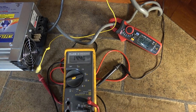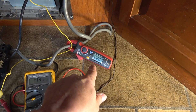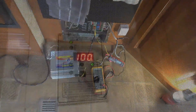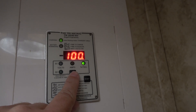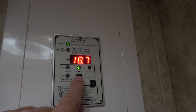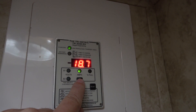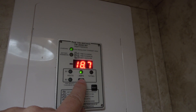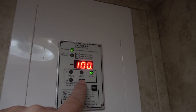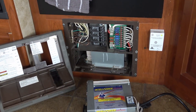The battery is up to 73% capacity, steady at 13.6 volts at the battery and 14.3 at the charger, pretty solid at around 30 to 32 amps. After about five hours the voltage is starting to go up — now 14.4 — and current is down to 20 amps. Checking the Trimetric: we're showing 100% charge. You can see the current dropping — that's what happens when the batteries reach full charge and the BMS starts to cut off the current. I'll call that a full charge.